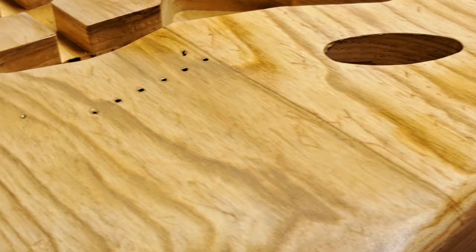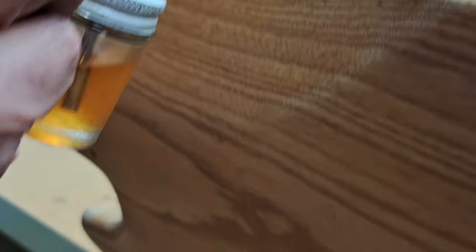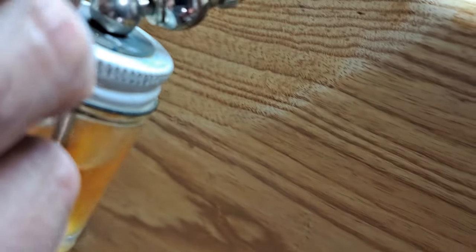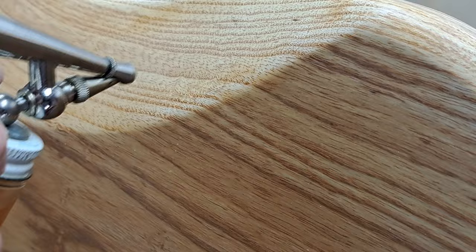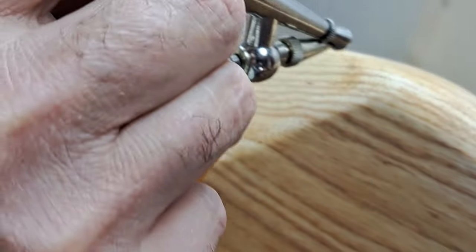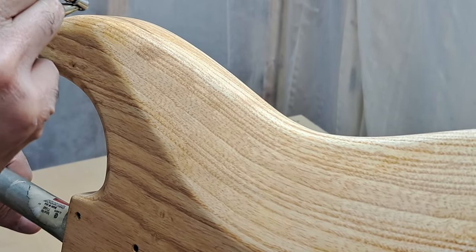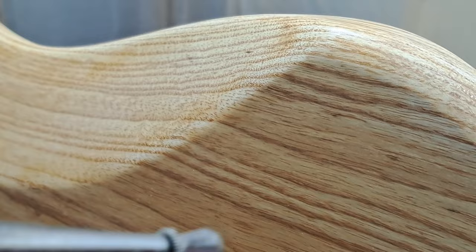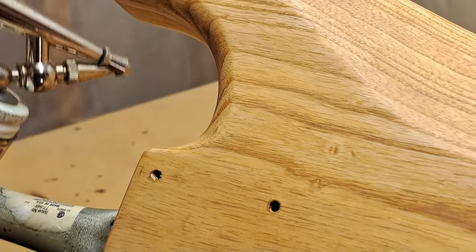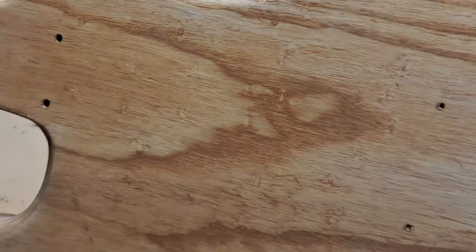So now I'm just going to go back to shading — I'm going to close my gun up quite a bit. That's the place where you've got to get it. That line right here — sanded through your finish a little, but the shellac is still there, it's just not as thick, just whited it out a little bit. But there will be areas where the shellac is gone, and this is good enough. The clear coat won't know the difference between this and what's right beside it — it will put it right back. It's just a sticky grab for the lacquer, your sealer, your barrier coat.